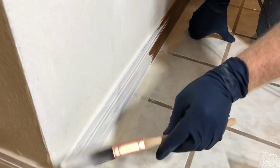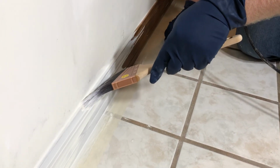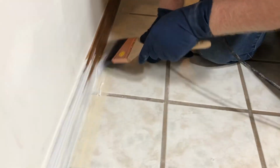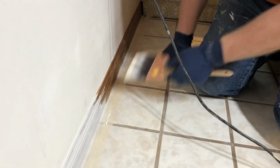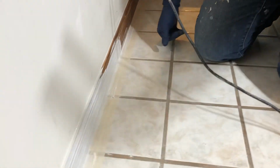You don't have to be on top of it. Don't create a shadow, okay? I want them to see the tip of this brush. That's it. See how that rides up there? I only got 1/4 of an inch of that brush doing the top. That's all I need. You see how that works out? Let's keep to our rule. Go in 2 directions. That's fine, but end it all in the same. There you go. This way you got no brush marks.